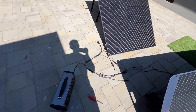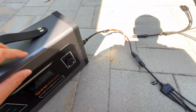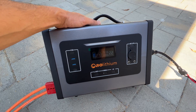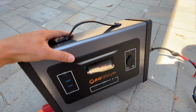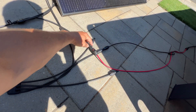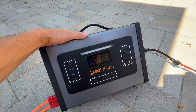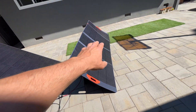It also looks like the power station has some problems with MPPT finding the maximum point. Right now we're charging with 274 watts. If I disconnect one panel we're getting about 220 watts from that panel. But if I disconnect the connector and reconnect it, we get 330 to 340 watts. And if I connect the other panel back in parallel, now we get the full 550 watts output. This happened a few times — whenever I leave the station for about an hour and shade hits any panel, it drops production and doesn't come back when the panels get unshaded.